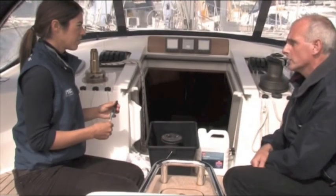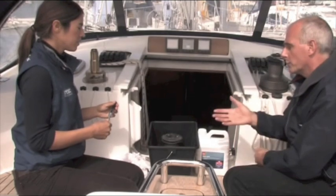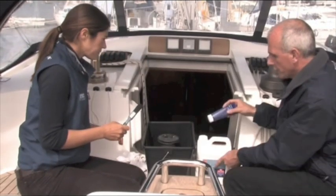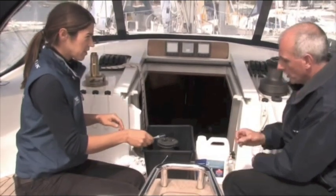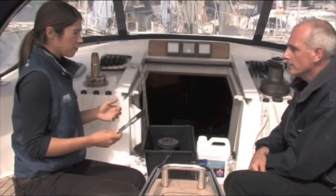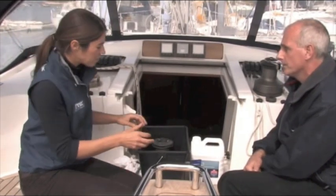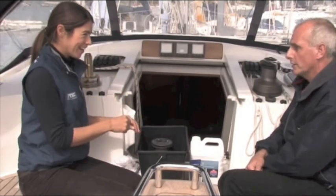Don't use petrol or gasoline as it can destroy the plastics. You also need a brush, obviously for cleaning all the grease off the gears. We've got the grease too. You can get it all as a kit or they're sold individually, so if you run out of anything you can go and buy it. It's also worth having spare springs and pawls at hand, especially if you lose a spring. Make sure you've got all these things before you start taking your winch apart and cleaning it.